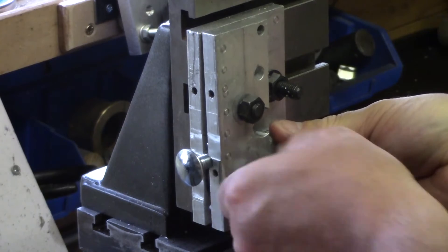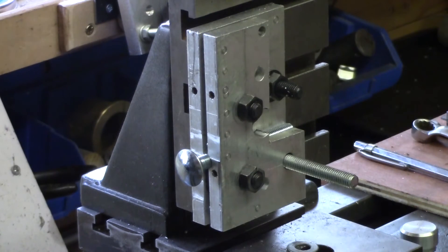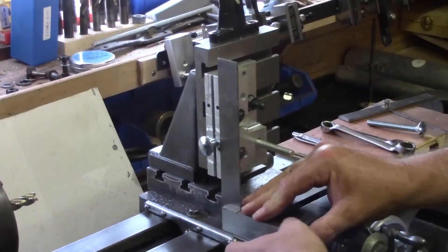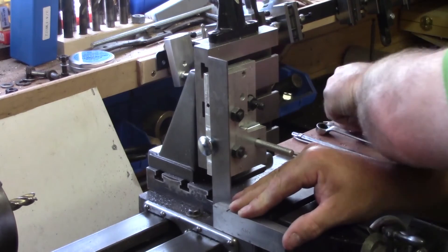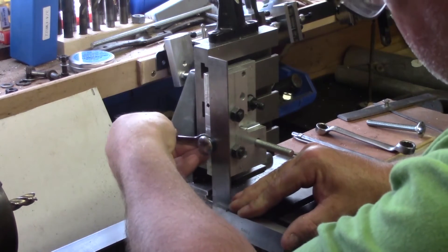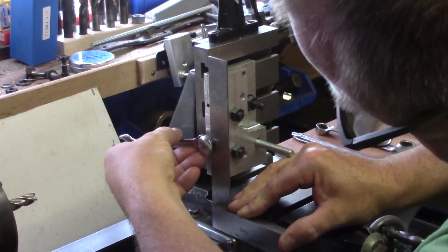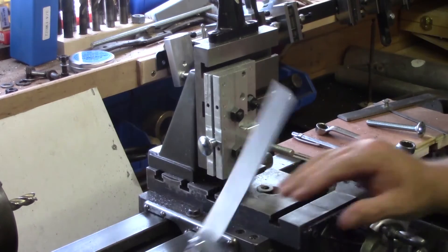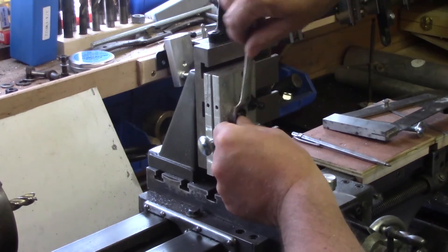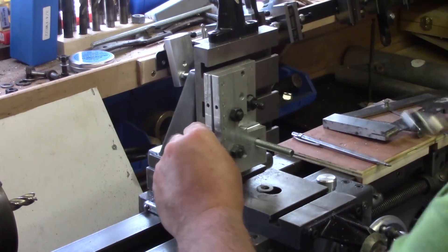It doesn't matter how far it's sticking out - we just gently tighten up, pinch up the screws. These bolts have got a square shoulder inside, so all we want to do is square up on one of those shoulders. I just use a square on the slide and a small spanner, and you can just turn that until you get it on a square. You can tell when it's there because if you try and turn it back it'll just snap into place. Once that is in, you tighten the bolts - doesn't have to be mega tight - and that will grip it nice and solid.